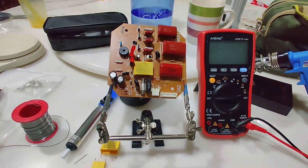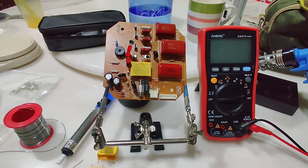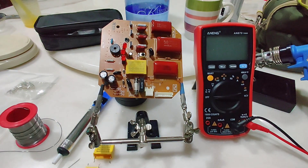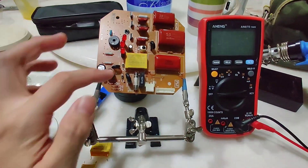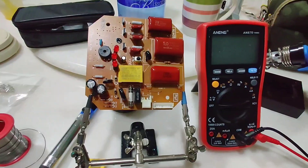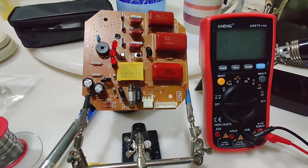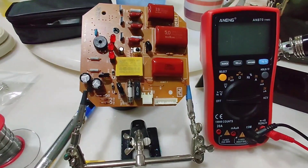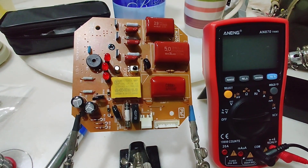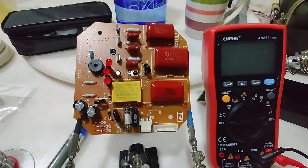If you encounter that, most probably you have issues with the circuit board, or more specifically you might have issues with the capacitors on the board. Usually it's quite cheap to just replace the capacitors — just a few ringgit. You can buy online or go to your local electronics store; they usually have stock on these components because these are very common failure items.